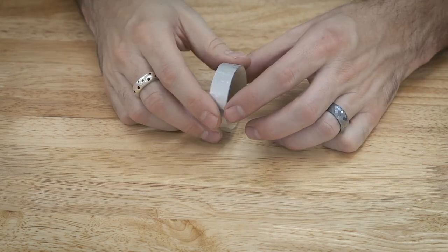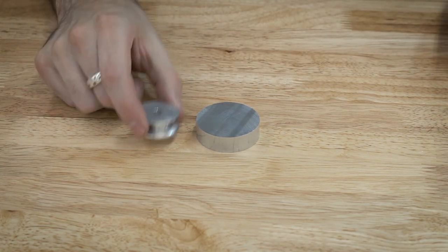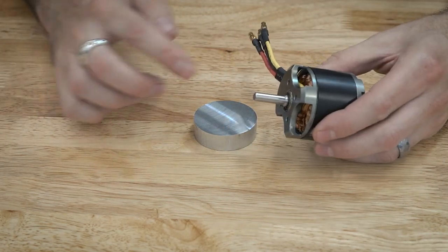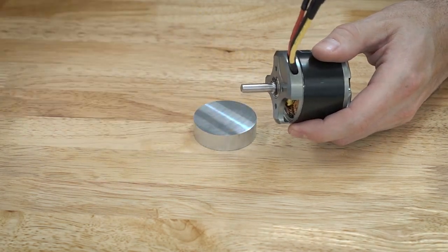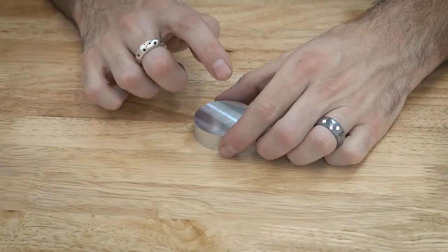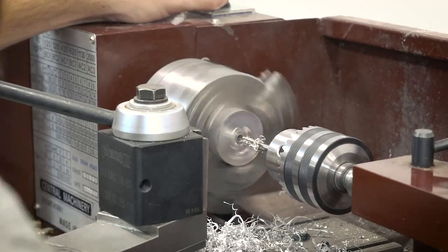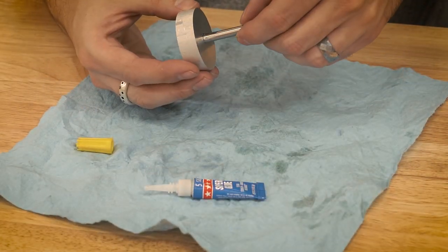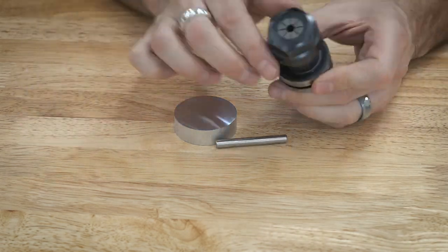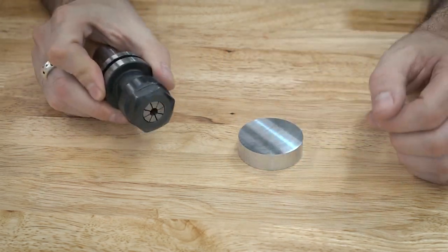Now I have this nice little puck of aluminum that is half an inch thick and 1.75 inch in diameter. I need to turn this down to my final pulley dimensions. The final shaft size I need to mount this on is a 6 millimeter shaft. So I'm going to use a 7/32-inch drill bit to bore out the center, and then use a 6 millimeter reamer to ream that to exactly 6 millimeters. Then I'm going to use a little steel shaft and super glue that on the inside. Once super glued together, it is just a matter of inserting this into an ER20 collet so I have a way to mount this into the tool holder on the mill and turn it.